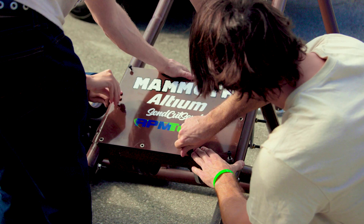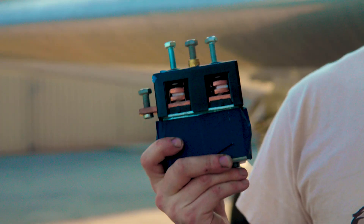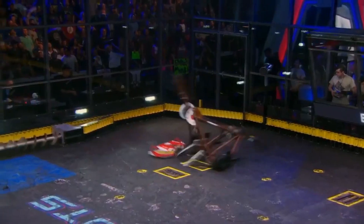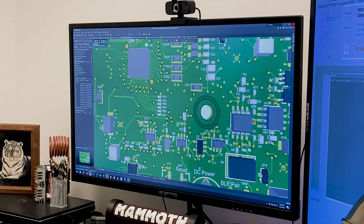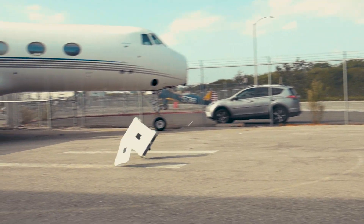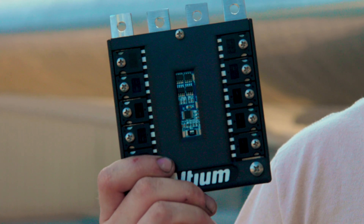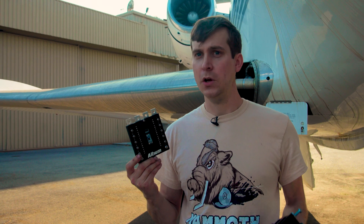We had a lot of trouble trying to find off-the-shelf components that were able to deliver the power handling capabilities — the voltage and the current — required for the weapon in Mammoth. Our previous contactor allowed us to switch on and off our weapon motor using mechanical movements, which can always be a point of failure, and it was large, heavy, and we did not have room for it in this year's Mammoth. Over the course of two or three months, I was able to use Altium software to develop a speed controller bespoke for Mammoth — able to handle the current and power required for Mammoth's weapon motor. This speed controller takes about 60 volts in and dumps about 1,600 amps into our large weapon motor, and it only weighs about half a pound. That saves us three and a half pounds we can put into armor, more into our weapon, and into high-priority, critical, reliability, and damaging components.